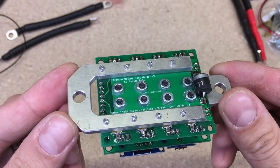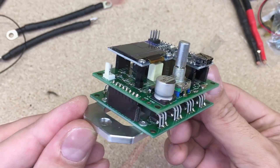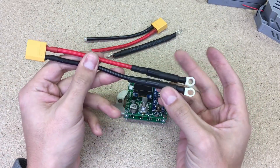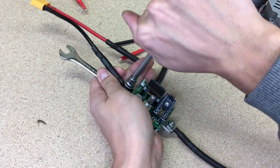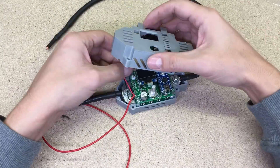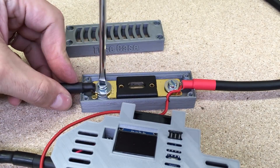This spot welder can be powered by a car battery or LiPo battery. I'll use a LiPo battery because of its size and ability to use in my other projects. From one extension wire and an additionally bought XT90 connector, I made a wire adapter to connect a 3S LiPo battery. Assembly is pretty straightforward — all you need is to attach the spot welder power source, secure the welding cables, attach the fuse, solder the fan and spot welder power wires, and put everything together in the 3D printed housings.